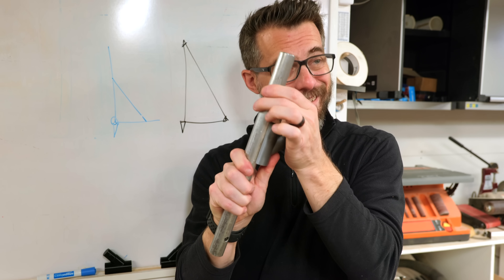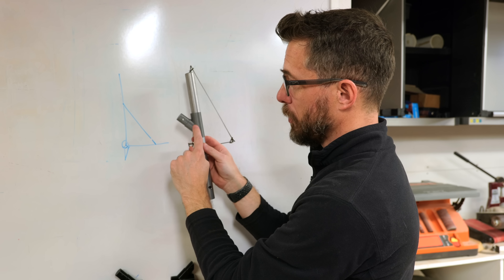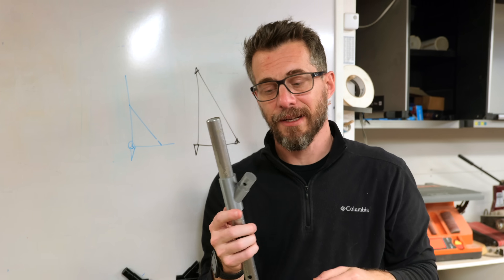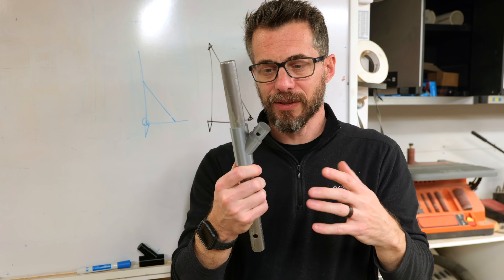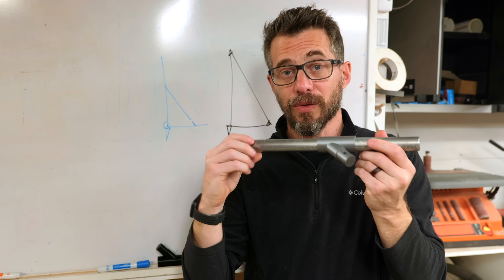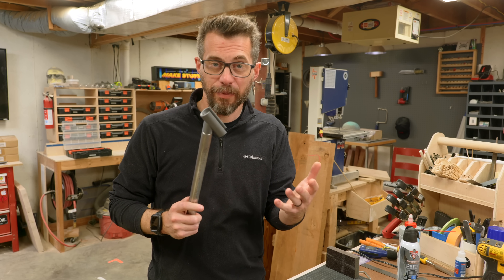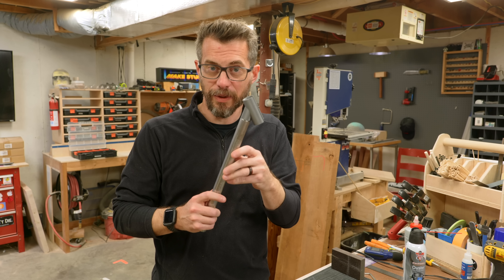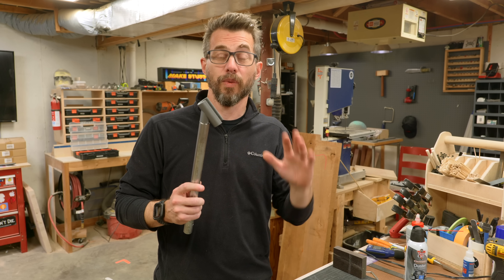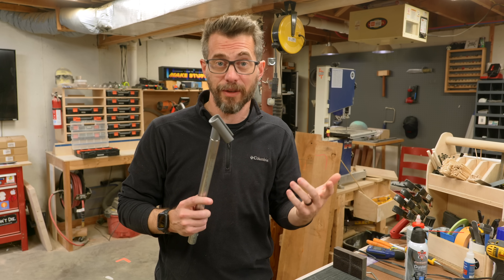This version has a tighter fit and I printed it with 50% infill so it's a lot of plastic — it snaps on nice and tight. This piece can actually become the gusset, so if I put one of these fittings on each end I can lock it to the upright and the ground position piece. Having this little system of pieces made me realize we could use the same post and build anything we wanted on the end, using conduit for all sorts of different projects. So with that in mind I challenged some of the other people on the team to use this same idea with the same conduit to come up with an entirely different project that doesn't have to do with the soccer goal.